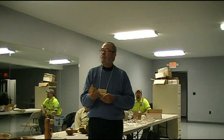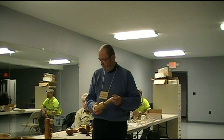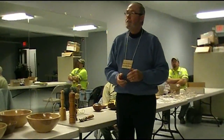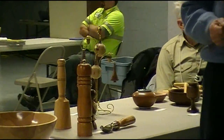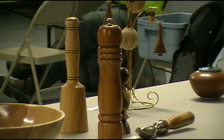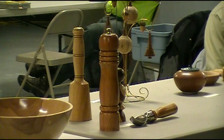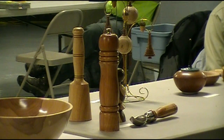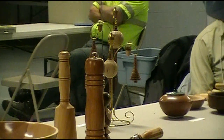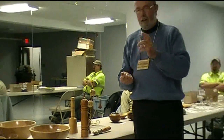Okay, I've been starting with like a 150, so I should start smaller. No, you gotta go down. You can start with an 80 or 100, or if it's real bad, start with a lot heavier grit sandpaper until all you see is just the scratches from the sandpaper. And then with each grit, you take those scratches off and add smaller ones. You can't skip a grit, stay with it. Okay, I haven't been skipping any grits, but I've been starting at 150. Yeah, you gotta start lower.